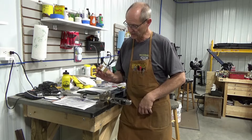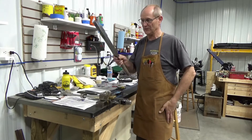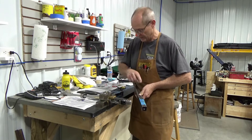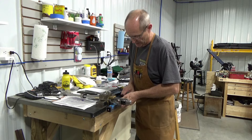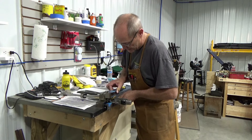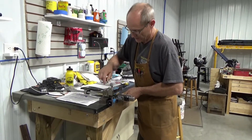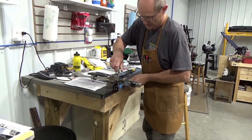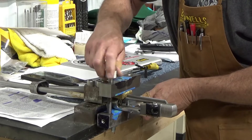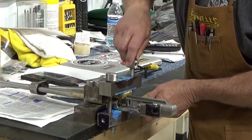So I'm going to place our specially made brass piece right here, and get my heavy duty trusty barrel wrench up under here. You'll notice I've got some tape on the barrel wrench so that we don't mar anything — we'll do what we can to protect the firearm as much as possible. The barrel vise I have on the table uses a rosin, which is a powder material applied to the barrel bushings to hold the barrel tight.